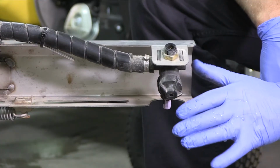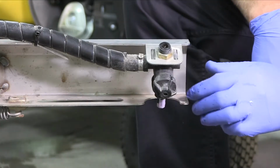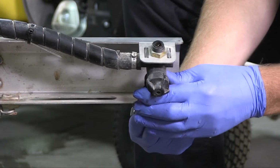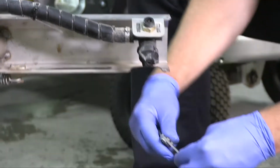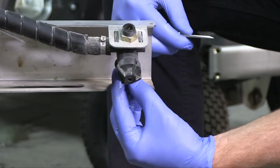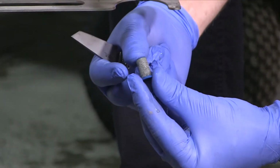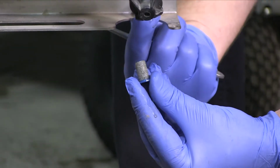To get the proper amount of liquid out of your spray tip, you may have 40 psi at your pressure gauge, but if your check ball screen is so dirty that the water cannot get out of the nozzle, you won't get the desired spray rate that you're looking for. You need to check these screens to make sure that they're not completely caked up and dirty. Liquid will just return into the tank. Even though you've got 40 psi, it's not going to come out of your nozzle.